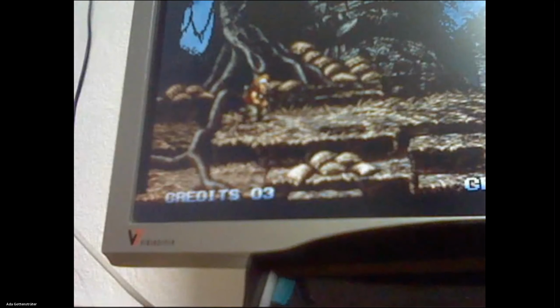Yeah, you just pick up your byte, and then the hardware looks up in the color lookup table the 24-bit pattern and outputs it for that pixel. Well, actually, the 32-bit pattern. You have to make sure that it doesn't get 32 bits async in. Yep.